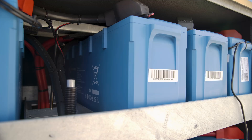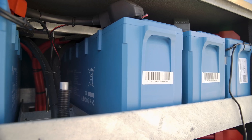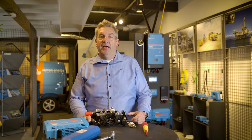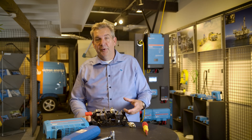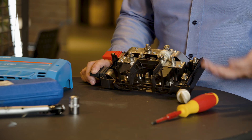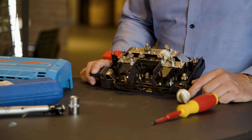So what is a large lithium bank? Basically you have to look at the data sheet of your battery to see what the short circuit current is. And if that exceeds the value of a mega fuse, then you have to step up to this Class T fuse. Then also according to regulations, you have done the proper setup.